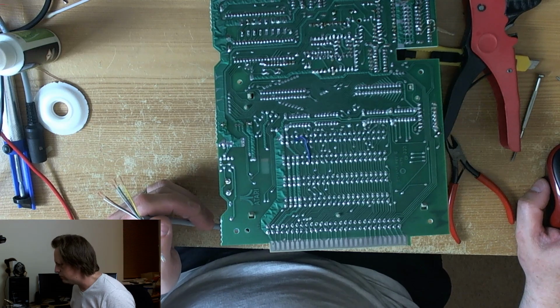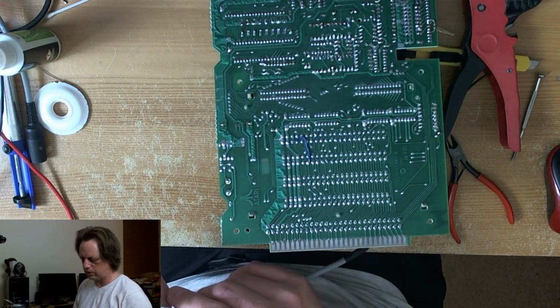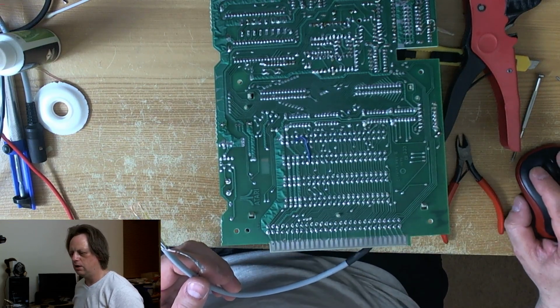If you don't have flux around, simply add a bit of new solder to get ancient solderings running. Yes, of course, for two reasons that adding solder will help get things flowing. One, most solder has flux built into it, so when you add more solder you're also adding flux.